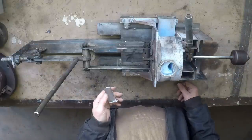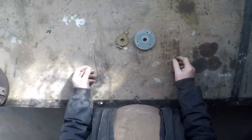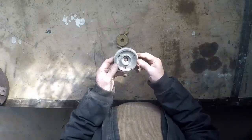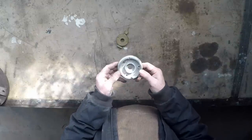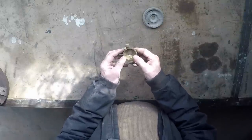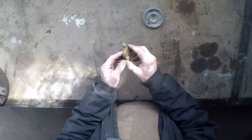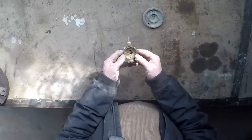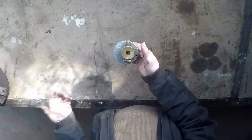Here are a couple of castings done in one of the simpler machines some time ago. That's a motor end cap — a little more complicated — and it didn't work all that well; it's a bit dull in the middle and a few other areas. I would have liked a better casting but it did do the job. This one was a bronze part for some sort of door opening mechanism, and it was an absolute disaster — not a bad looking little casting, but my furnace isn't well enough shielded to allow you to stand close to it all day and ladle bronze. I just about passed out after about an hour and had to scrap the job.